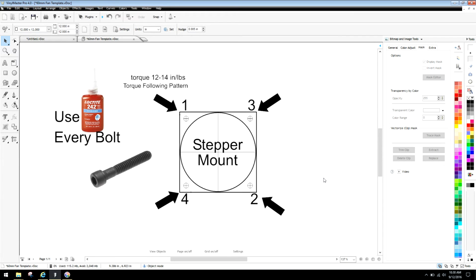So once again, we now know how to tighten bolts and how to go through and do this systematically. If you have a 2-bolt process, we covered 4, we covered 3, 2-bolt is very simple. Once again, always hand snug, bottom it out. Once it's bottomed out by hand, and when I say by hand, guys, let's use common sense.